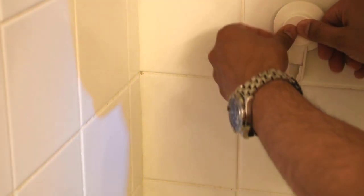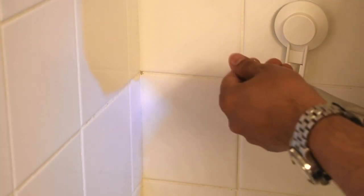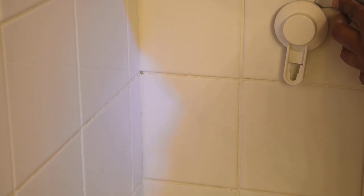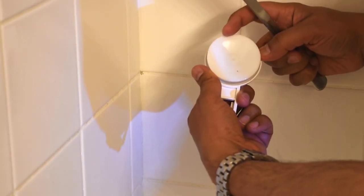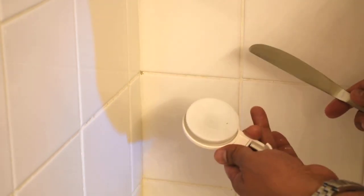Now I'm going to reapply it and use the third technique. The third technique involves using a butter knife, but because this is pretty sharp I'm going to use some baby powder — it's more common in people's washrooms. Just put some on the tip, rub it gently to give it a nice smooth coating, then place it in between the silicone and lift up. There you go. This is a very fragile area for the silicone so you don't want to mar or cut it — that's why I put the baby powder on the butter knife.